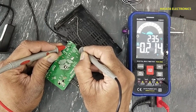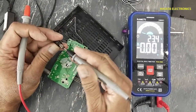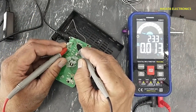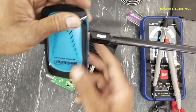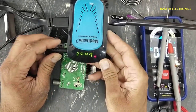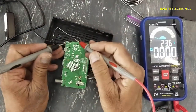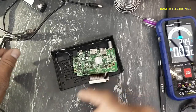You can see the voltage output dropped from 12 volts when we connect the supply. Since the power supply itself is good, that means we have a problem here in this receiver — it is dropping the voltage. We can also try to apply a high current supply to check the problem.